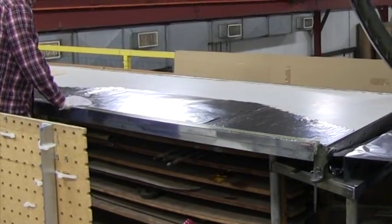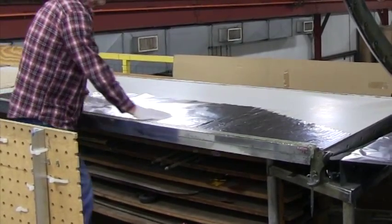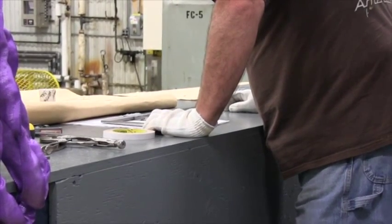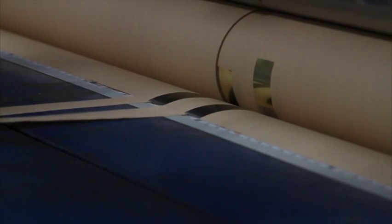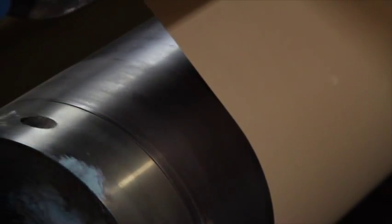The cutting operator has to assure that the foil surfaces are kept clean and cut edges are smooth and free from slivers. A bushing's central conductor, wrapped with the concentric cylinders of insulation and foil conductors, is commonly referred to as the bushing core.